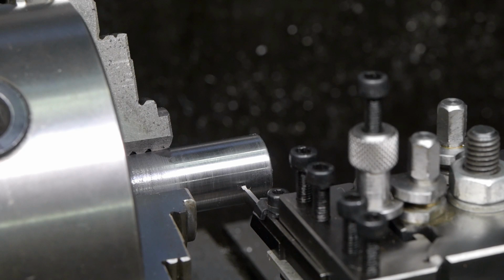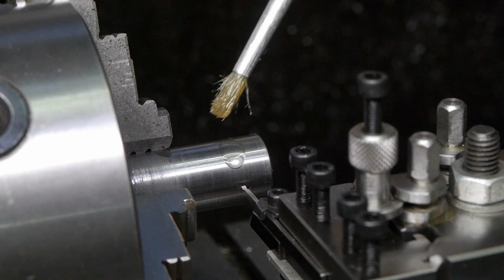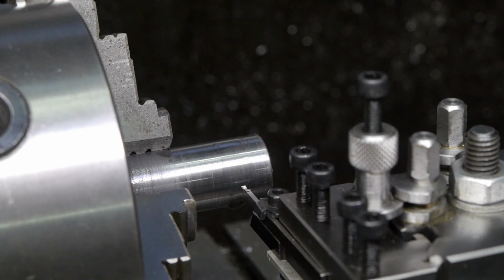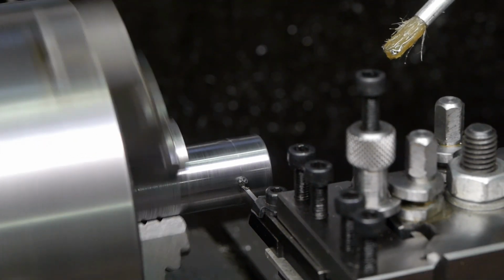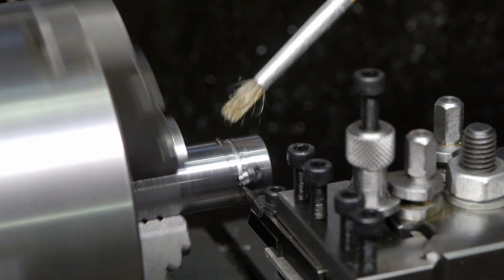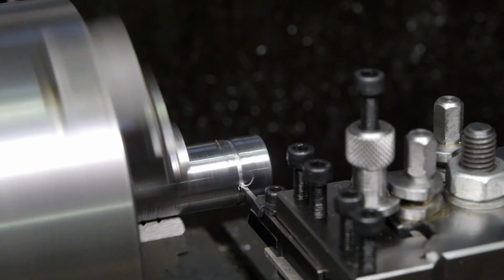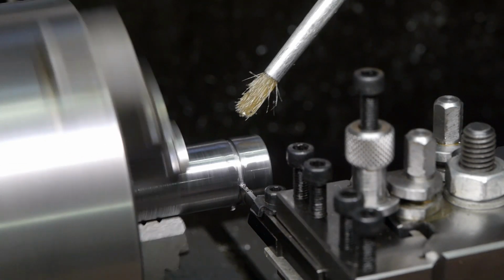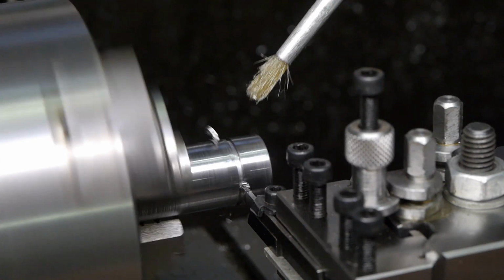Setting the lathe to the slowest speed, and that's 115 RPM. Now my lathe hasn't been a miracle when it comes to parting off, and this has quite a bit more stick out than a short parting blade, but here goes nothing. Noises coming from the headstock.